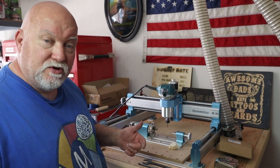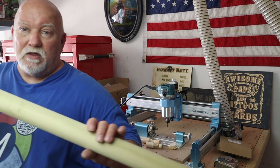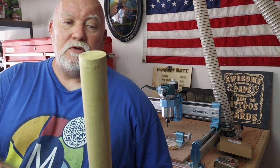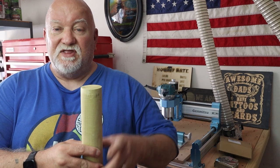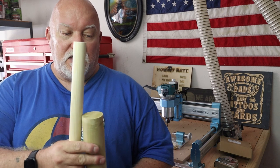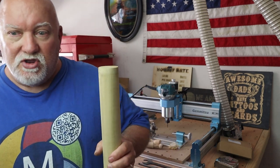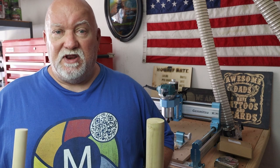You can put square stock in this and turn it round. Or you can buy round material, which I did — I went down to Lowe's and bought some poplar, about four feet long. I'll mark a center mark with my tape measure and a pencil, cut them down to the right length, put it in my drill press to drill a hole down the center, and glue a dowel in there so I have something to grip. You can also take some two-by-twos or two-by-fours, glue them together if needed, clamp them, cut them down on your table saw or chop saw, and put that material in here. Depending on the software you're using, you can take square material, round it, and then run your job.